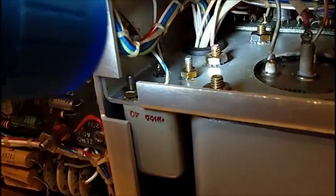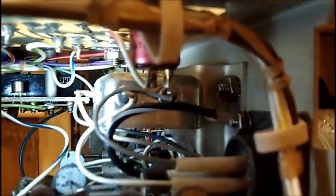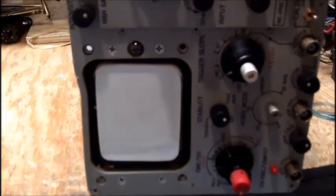Even though this is a transformer with screws, I don't know how you're supposed to service it. There's the frequency control — I turned it with the scope on and it didn't do anything. I don't know whether that's a frequency adjustment for the high voltage, or if it adjusts for the line frequency when running on 400 cycles. I could be way off base. Also, I can't buy these plugs — I'd probably hardwire a three-prong plug in there. There are three connections: one goes to the chassis, and the other is the hot and the neutral. It's even got a bathtub capacitor up in the top inside. This is going to be my next project.